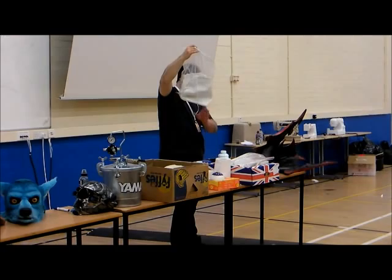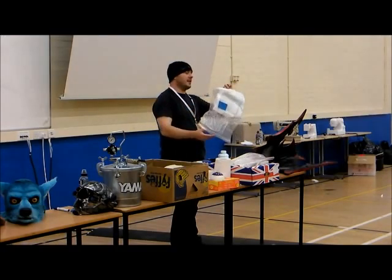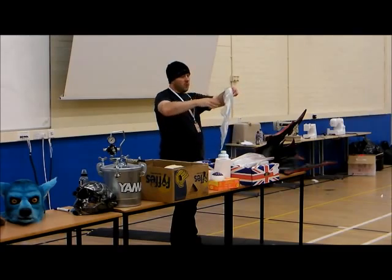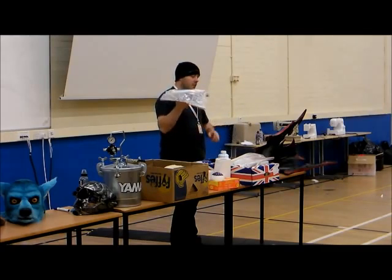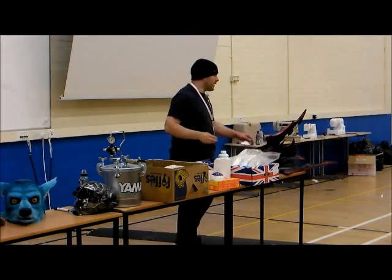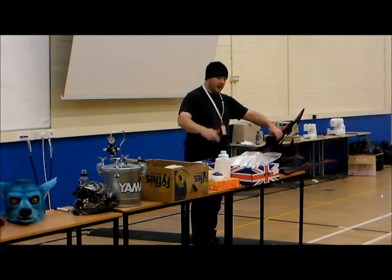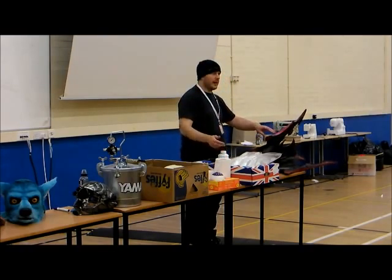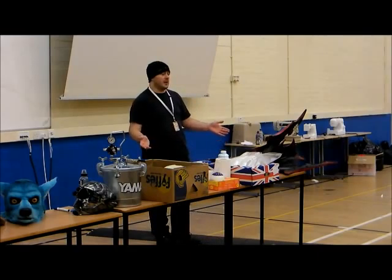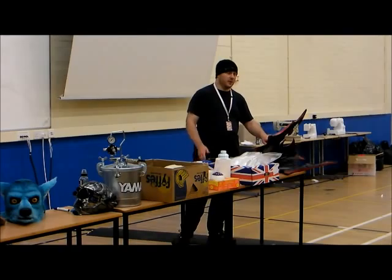It's matte cloth. They call it matte cloth. And it looks like fabric. It's actually glass strands woven into a mat. Reason is, it's stronger and lighter. I had to go 5 thick on this, so 5 individual layers. I probably could have got away with 2 or 3 with that. Obviously, 2 or 3, a lot less weight, a lot less resin would have gone into it.